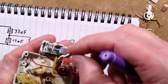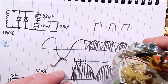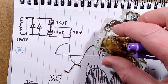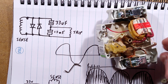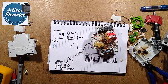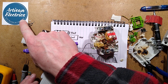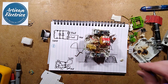It just looks like a standard circuit breaker failure. I do wonder if that's down to the odd characteristics of electronic power supplies versus traditional resistive loads - that pulsing nature may be exacerbating the problem and resulting in premature contact wear. Thanks Jordan for sending that - it was very interesting and well worth taking apart and exploring. I shall link to Jordan's video below so you can see the unit that this circuit breaker was taken out of.